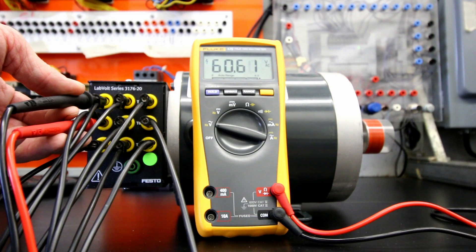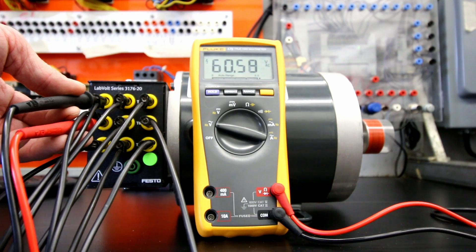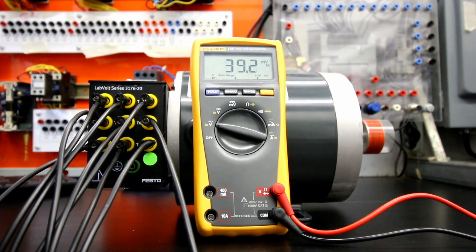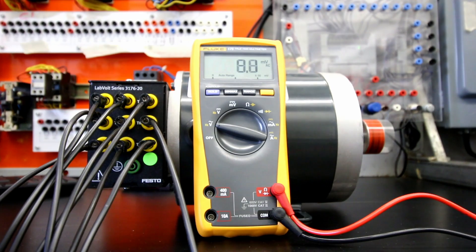This is exactly what you need to figure out in shop. When provided with 208 volts, the low voltage connection gives 120 volts per winding — correct. For the higher voltage series connection with 208 volts supplied, the expected voltage per winding is 120, but we're only seeing 60 volts on each winding. Figure out why. Hopefully this has helped you label your connections and understand how the dual-voltage motor works in both low and high voltage. We'll see you in the next video.